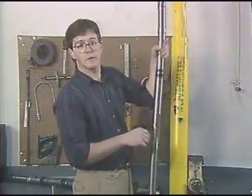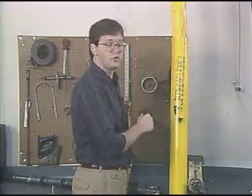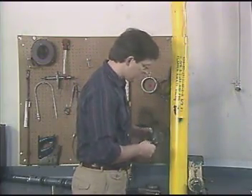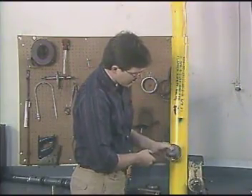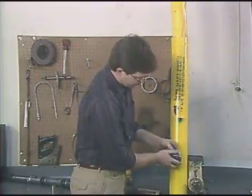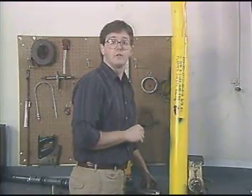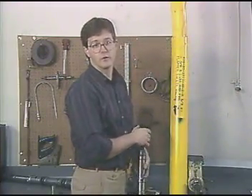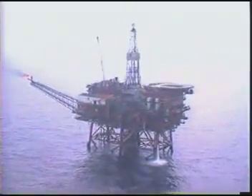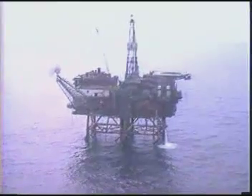These valves come in a variety of designs, which may have single or dual hydraulic control lines, either ball-type or flapper-type valve mechanisms, and special material designs for sour, sandy, or high-pressure service. The setting depth for subsurface safety valves is often a matter of government regulation and company policy.